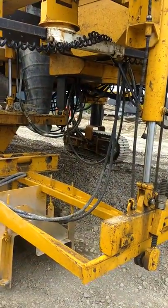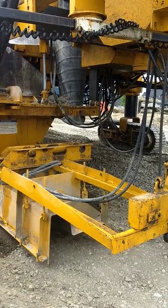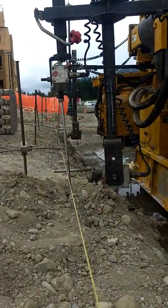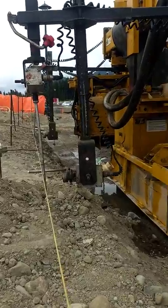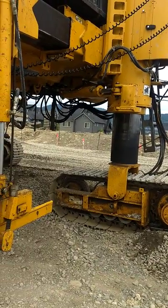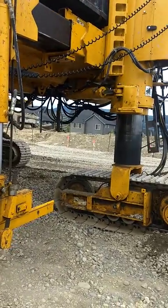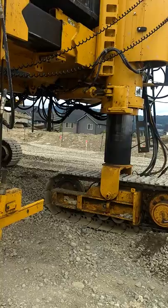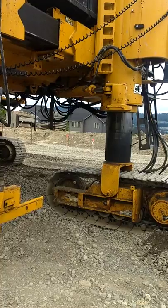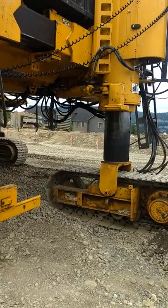It's got a big hump of dirt and gravel. This machine has sensors up on it that'll keep it level. These sensors here — they can follow the string — so those legs, these tracks are going to adjust as the machine pours along. Those tracks will go up and down, those tubes right here go up and down, and it steers. I'll move the string — you can see it go up and down, it's going to go up. I'm not going to be shifting it right by a wand, you can hear it moving.